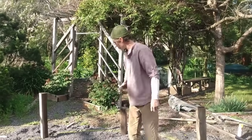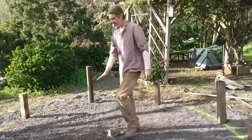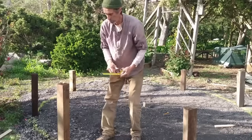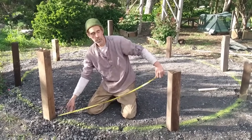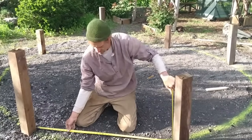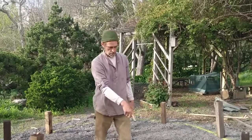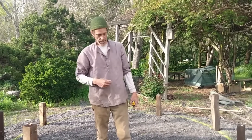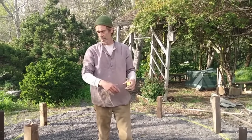First thing I did was put the base rock in and work on leveling it out. It was considerably higher here, so I put in about 6 inches to make it level — tamp that down. When you measure, you measure from the inside corner to the inside corner. Now we're ready to start making our holes. We'll be setting the posts in concrete. You can use pier blocks also, but in this case setting the uprights in concrete in the ground makes more sense.